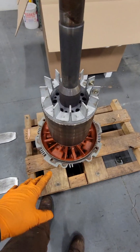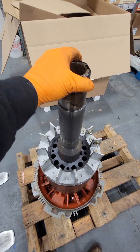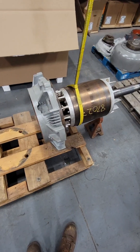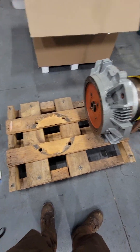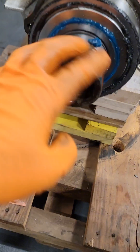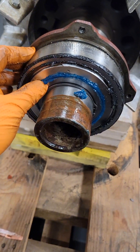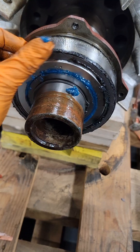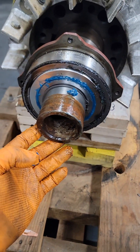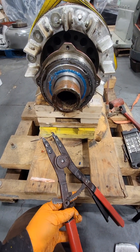The last step to completely disassemble is to lay the rotor down. I like to wrap electrical tape around those threads so we don't ding them up and have an issue putting the spanner nut back on. We'll remove the four bolts on the bearing retainer. This rotor weighs 590 pounds, and there's a snap ring on here. You can see fresh blue grease surrounded by some fresh black grease. Once we get this bearing pulled off and the end bell housing cleaned, we can assemble the lower end. We've ordered the top-side bearings and should be able to put this back together in a couple of days.